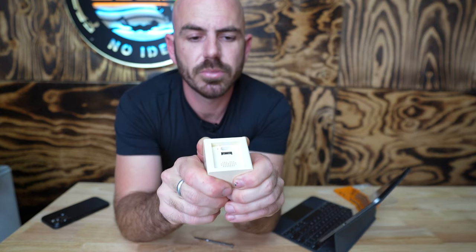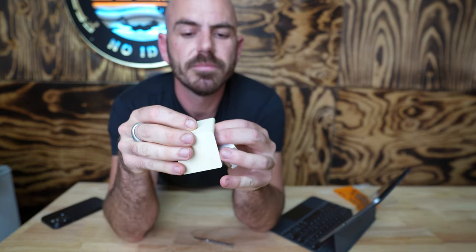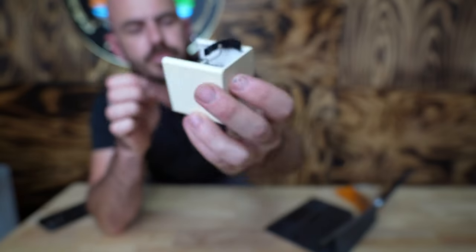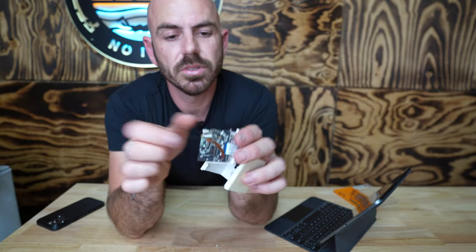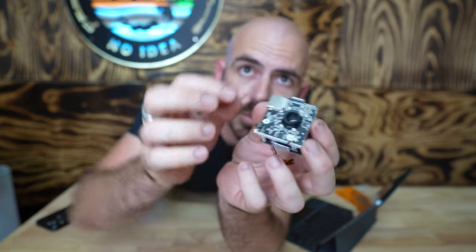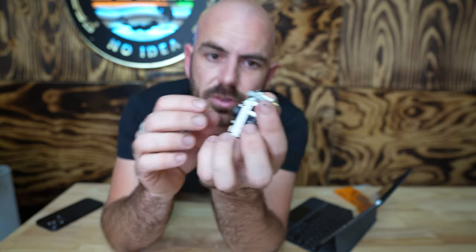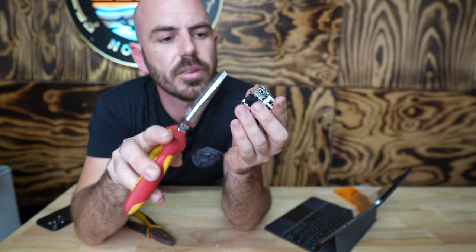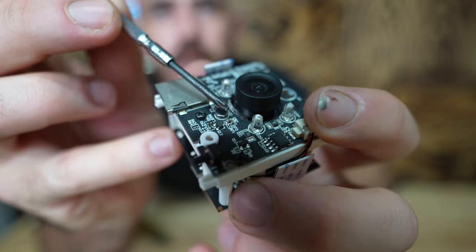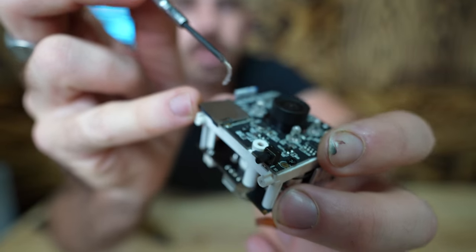From here we can just push the sides like that and remove the speaker. There's going to be a screw in here and the antenna just peels away. Undo that one screw in this hole and the whole board pops out. What we're trying to achieve is to take this lens and twist it away from the sensor — that is going to shorten the focal length on the lens. This is going to be glued in; I can see the glue.